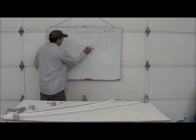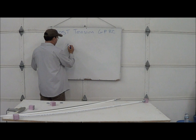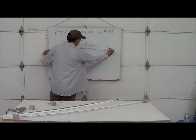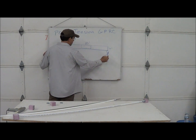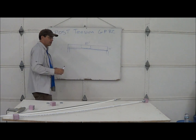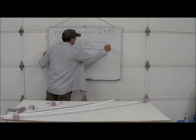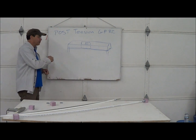One practical experience: I had to make a sink — an apron-front sink that was about eight feet long, maybe ten inches deep, supported only on the ends. I ran two half-inch rods, one on either side of the sink, and cranked them in post-tension. You could actually see it bend upwards, so I backed off a little. We had an eight-foot clear span with a sink in the middle and no visible means of support underneath.